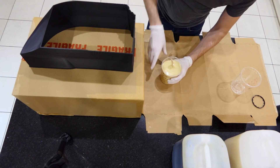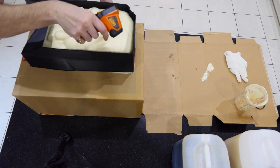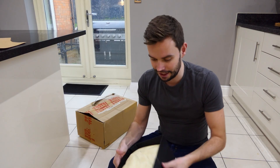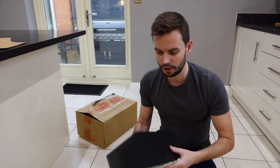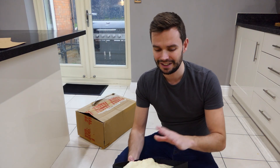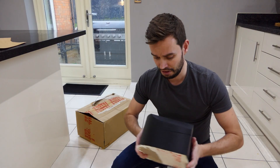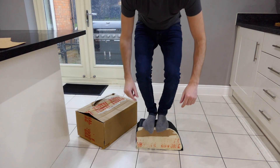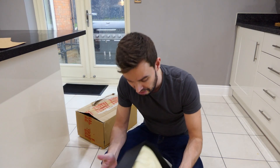Each piece was hollow, so I used special expanding foam which expanded 20 times its original size and set rock solid. The test piece came out really nicely — light, around 750 grams. One concern was the exothermic reaction: it got up to about 80 degrees Celsius, which is around the temperature PLA starts becoming malleable, but with seven outer layers it held together. Strength-wise it felt pretty strong — I reckon it could take my weight. No problem at all. I think this foam is going to be a good option, and I hope it fills out the little gaps.